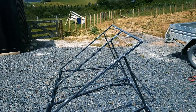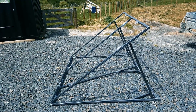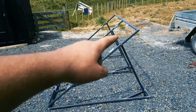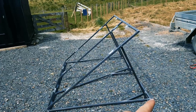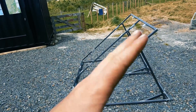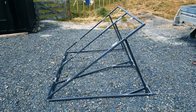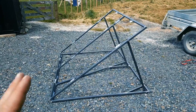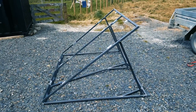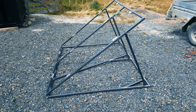That's the frame, and at this point I've got them at a 53-degree angle. What I've done is put it on hinges at the bottom, so all I have to do is replace these arms and I can change the angle depending on which month it is. Apparently 53 degrees is optimal for this time of year — it'll get flatter in summer and stand up more in winter.